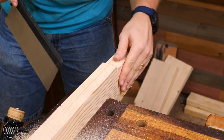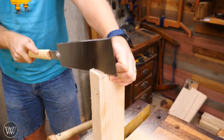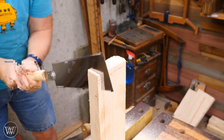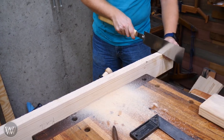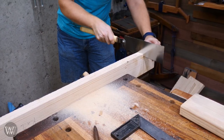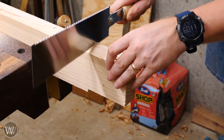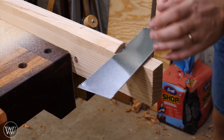After doing this for a little while, I thought I'd try switching over to the Japanese tools and learn them on this, because the pine is actually great for that. They work very efficiently in softwoods as opposed to hardwoods, at least in my experience. So with this Ryoba, I can easily cut down the cheek — you can see how I started it with one hand and got a little closer so I could eyeball it, then stood back and held the handle with both hands and it went fairly quickly all the way down. The nice thing about the Ryoba is that with one saw I can flip it over and use the crosscutting teeth to cut down the shoulders on the tenon as well. All told, it went very well and I think for pine joinery I'm going to be grabbing this a lot more often. It cuts very nicely and leaves a smoother surface, which makes me very happy. If you want to see more, I have videos on Japanese saws as well.